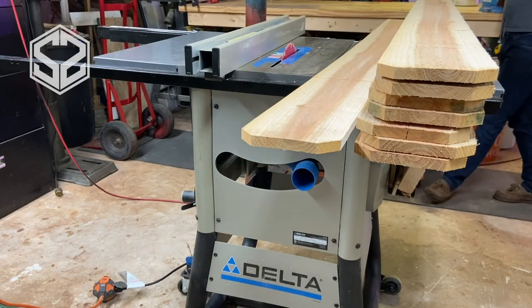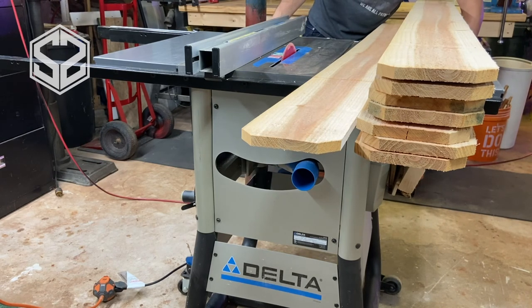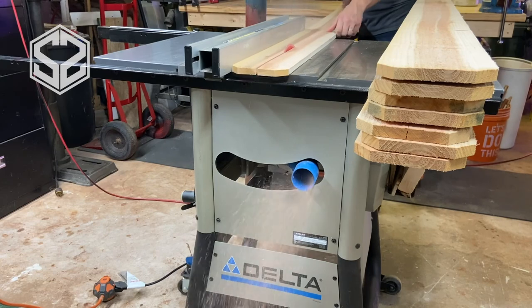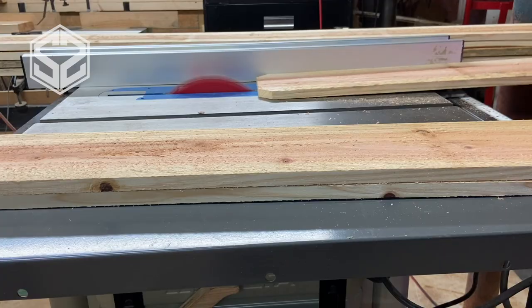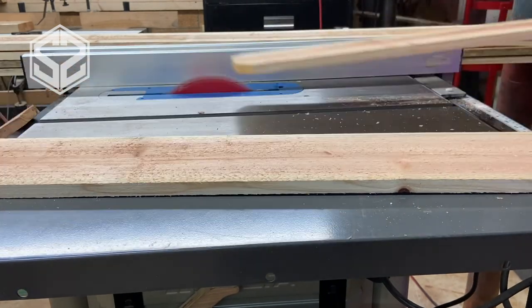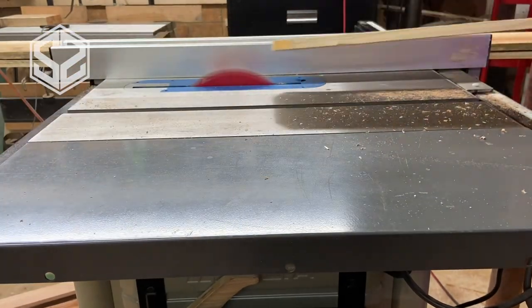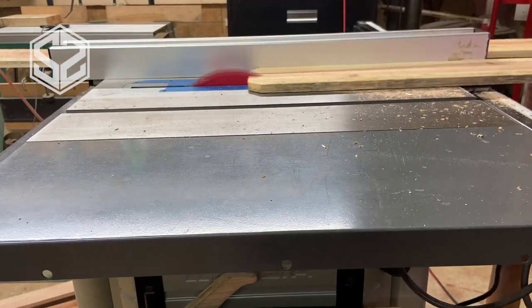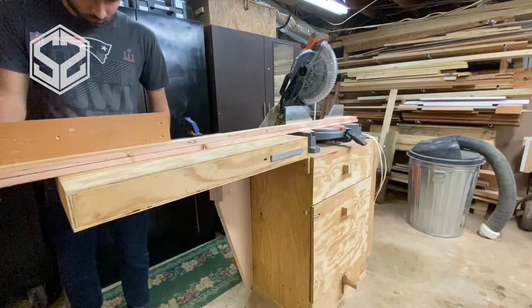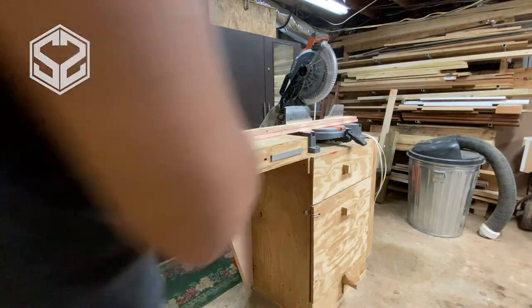To start out, you can buy fence pickets and choose whichever style you want. We actually cut our own pickets for our front picket fence, which we just installed a couple weeks ago, so I'm going to make this one to match. I started out with six-foot dog-eared cedar boards for fencing and I'm going to rip these down the middle. I went with cedar for two reasons: pressure-treated has to dry and cure before you can paint it, and cedar is a lot lighter, so it'll be much easier to hang.